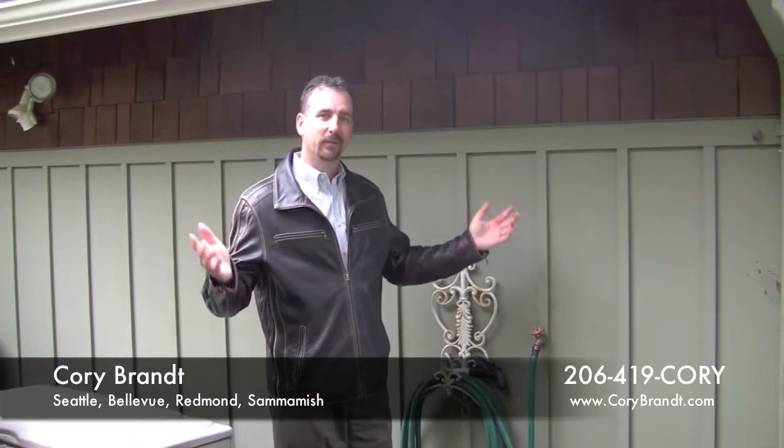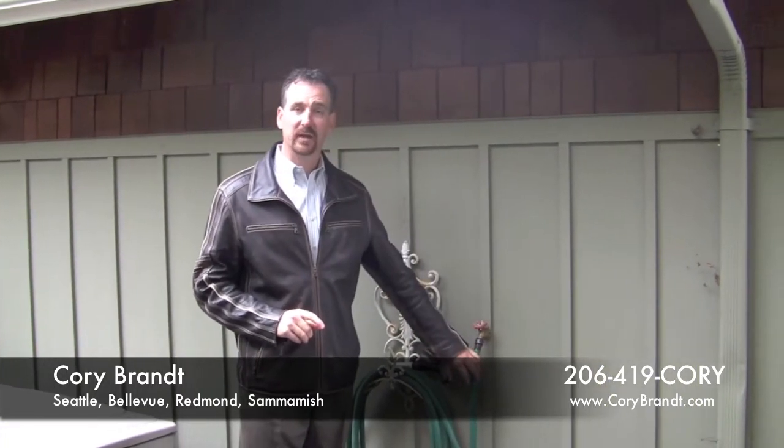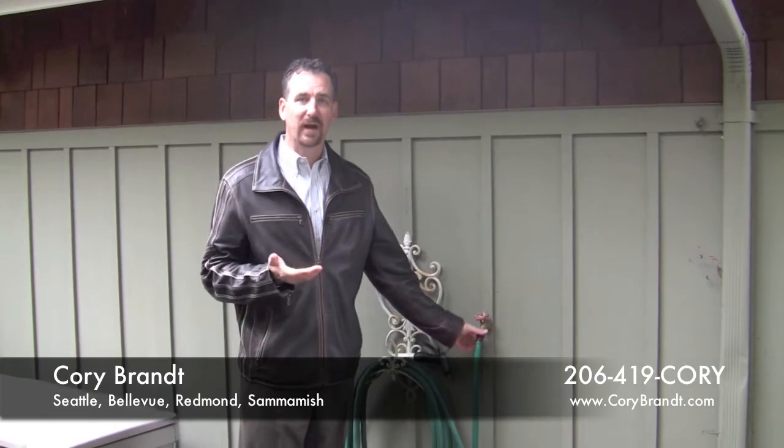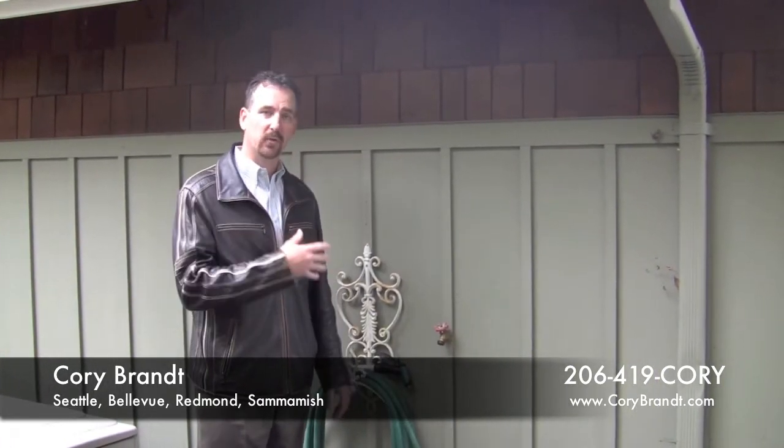Okay, so it's time to get ready for the winter. You get to go around and do your little checklist around your house. Probably the number one thing on my list every year is the hoses and the hose spigot. First thing is, during the winter, never leave your hose connected because it's just inviting a problem. You're holding water there. So that's the first thing. You disconnect the hose from the hose spigot.